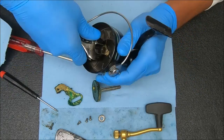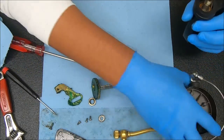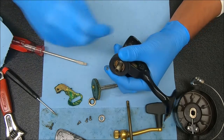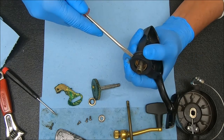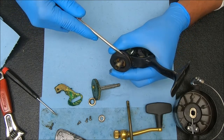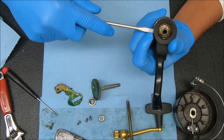To get the pinion out, we're going to remove that nut like so — rock it as you pull it up. We want to be a little bit careful with these parts because they're getting more and more difficult to find, so we don't want to go crazy and pop it off. We'll just go kind of gentle, because of the screws that we're going to have underneath there.